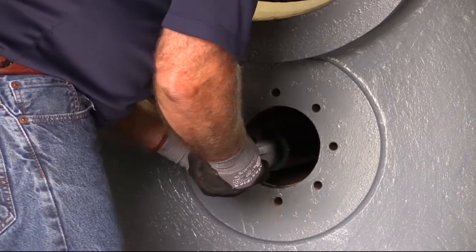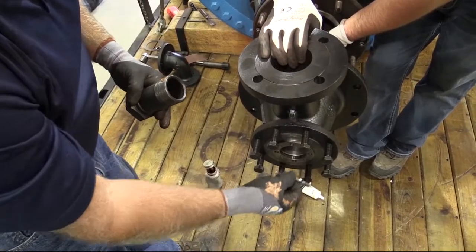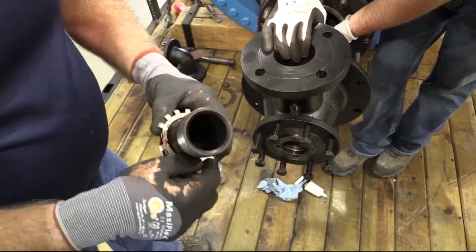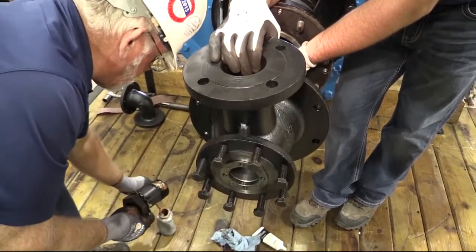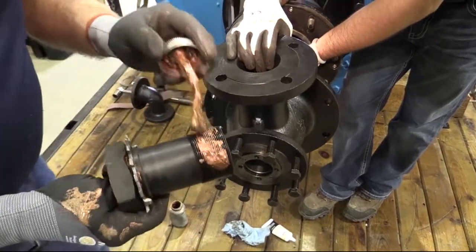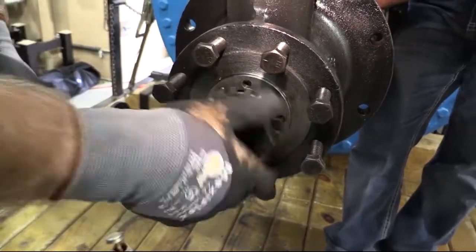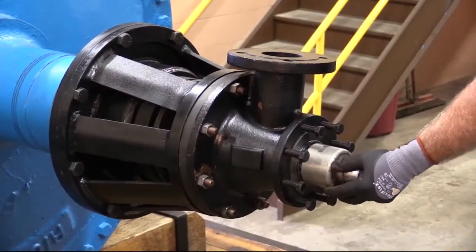There may be one or four pins in the body socket. Position the tab washer on the hollow bolt so that the bent tabs will be pointed towards the body. Lubricate the threads on the hollow bolt with never-seize and thread it into the support tube. Position the bent tabs into any of the four holes in the body as the hollow bolt is tightened.